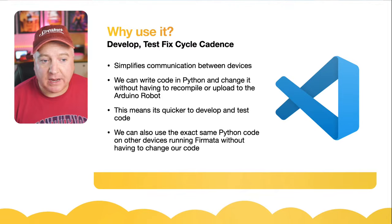So Ovi's asking a question there. Hi Ovi. He says, is it possible to connect an ESP chip to an Arduino motor controller? That depends on a lot of things. It depends on voltages. Arduinos tend to be 5 volts, so all the pin outs on them are 5 volts. If you have an ESP32 or 8266, I think they are 3.3 volts, so you can't just put a motor controller board like one of these for the SMARs on top of it. I don't think that would work. You might have to put loads of voltage divider resistors on there. That's the quick answer to that one, I think.